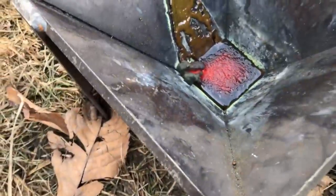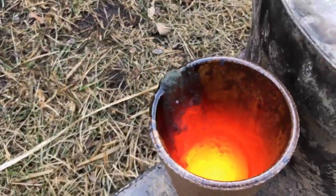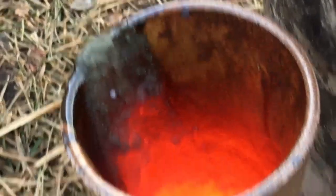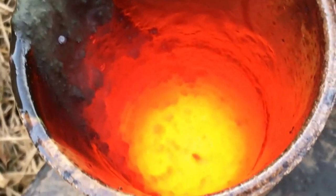So that kind of sucks. We had a lot of junk in there that didn't melt. I think I got too much waste oil in my mix. Yeah, I see a bead of metal right there — that was on the bottom. Not good. We're going to redo this.